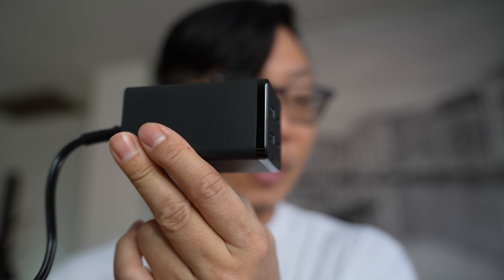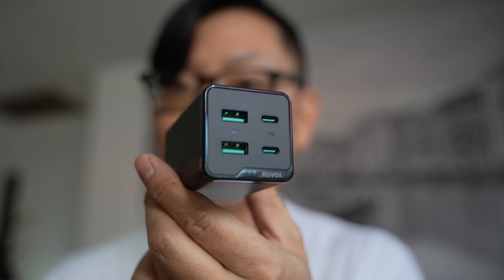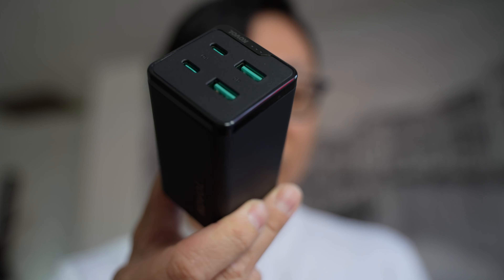This is going to replace my MacBook charger because it's going to easily be able to charge any MacBook or MacBook Pro just fine. It's going to replace at least a few other pieces in my kit as well. Some laptops actually do support the full 100 watt USB-C PD charging, and that's generally good enough. If you're not doing super heavy duty gaming, even at high resolutions, you sometimes don't hit that 100 watt mark for some of these ultra-thin gaming notebooks. But if you are doing a lot of gaming, this will max out at 100 watts per port, and you can't double up on ports to get to a higher wattage. But for everything else, this is perfect.